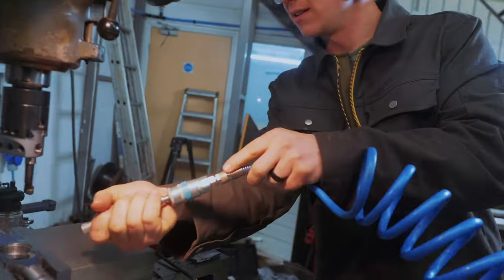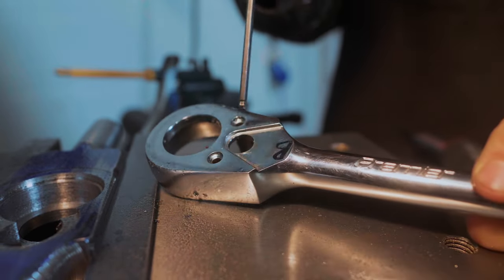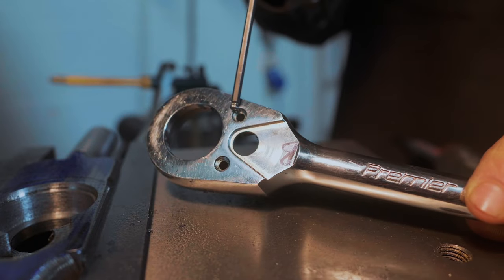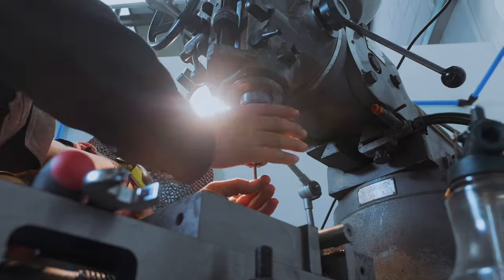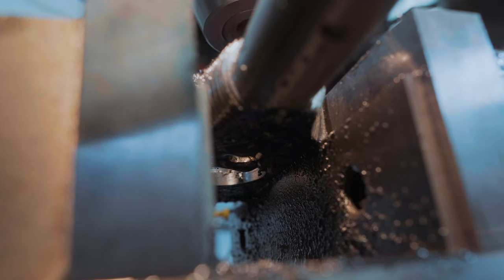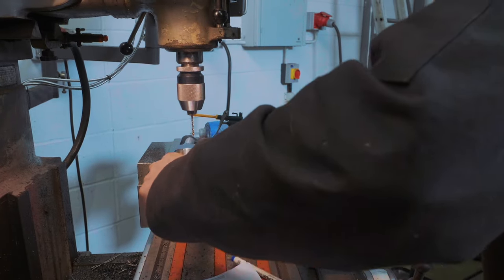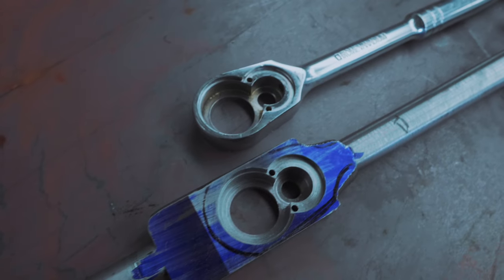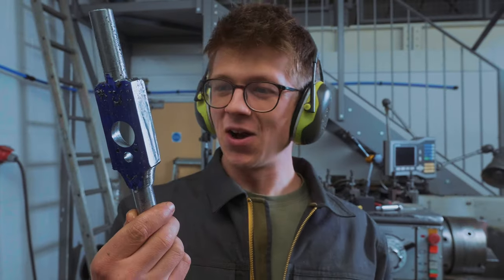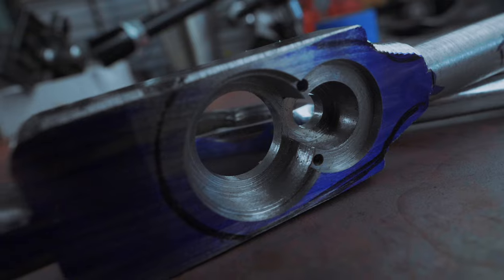We are there. Next up we have to make these holes — these are clearance holes, they're unthreaded, and on the back they will be countersunk. But since it's all set up and centered up, we'll drill it from here. A-side is done. Those holes were two full days of work. It was ridiculous — the amount of tool adjusting and tool sharpening I had to do. But we got it done. A-side is done.